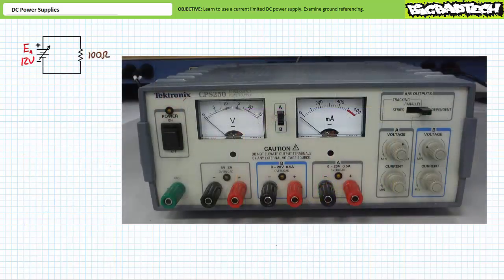Burning electrical components makes a great segue into a discussion on current limitation. This is a current-limited power supply, meaning there are hard upper limits of current and power this power supply is capable of delivering, beyond which output will be attenuated or reduced to prevent damage or disaster. This is a great feature for a basic electronics lab where what can go wrong often does on a disturbingly regular basis. You'll note each adjustable voltage source can provide an upper limit of 500 milliamperes of current.